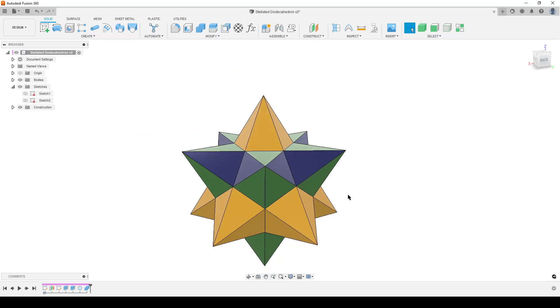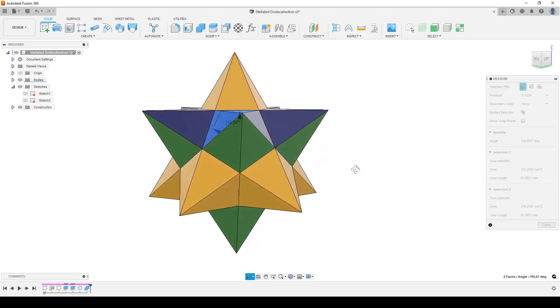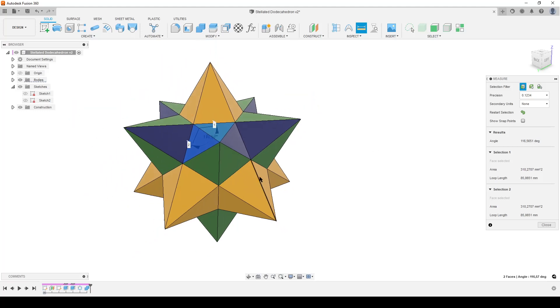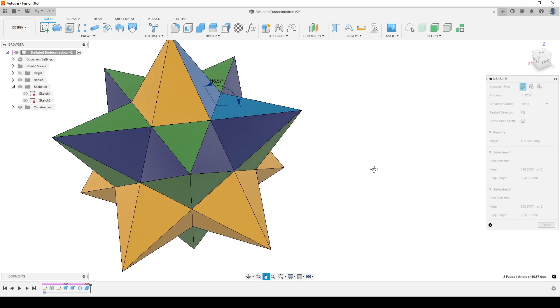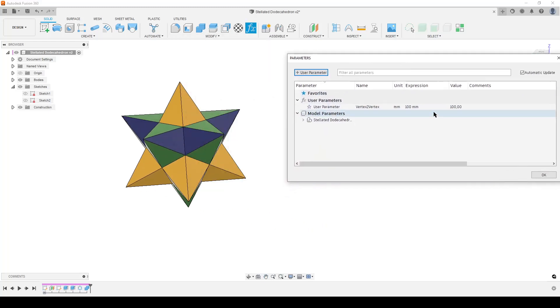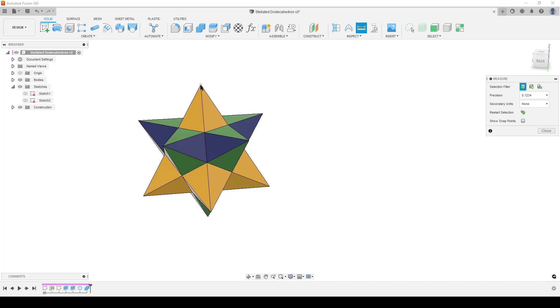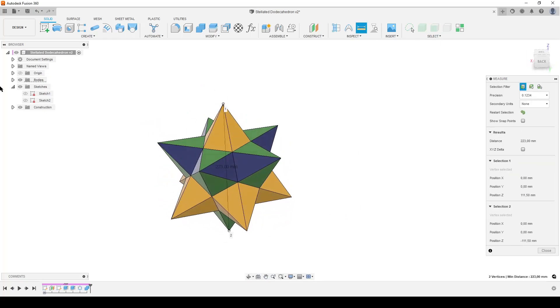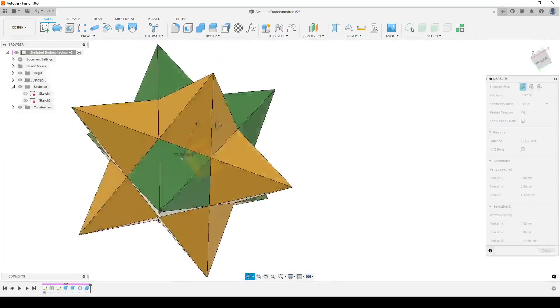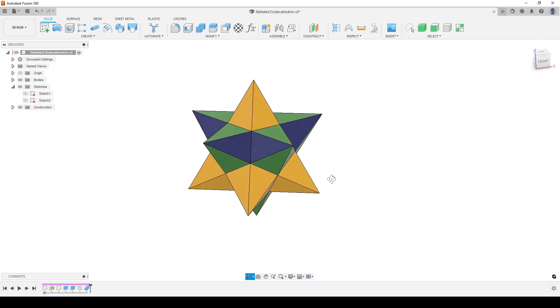You can see these edges align — the angles for all the extrudes or lofts are the same the whole time. This is a parametric model driven from one parameter. If we measure the angle, we select one face; the inside angle is 116.5651 degrees. The outside angle of the two adjacent faces is the same. We can change the size — say 223 millimeters — and that size refers to the vertex-to-vertex distance. The origin point is in the center of the body, which makes things easier without needing extra angles, axes, or planes.